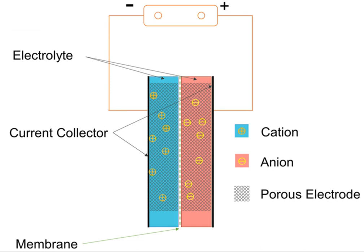Supercapacitors are used in applications requiring many rapid charge-discharge cycles rather than long-term compact energy storage, within cars, buses, trains, cranes and elevators, where they are used for regenerative braking, short-term energy storage or burst mode power delivery. Smaller units are used as memory backup for static random access memory (SRAM).